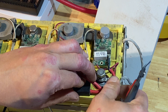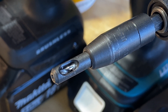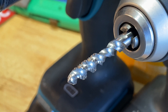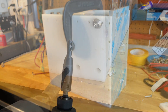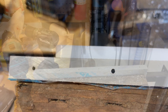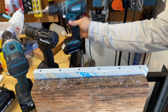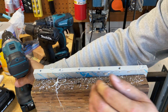The white wire connecting to each BMS board is the healthy signal. This is a pilot-guided drill bit used for drilling centered holes, followed by a standard drill bit, then an upcut tap which sends all the chip loads up out of the hole, and finally a countersink. The drill guide has a 6 mm diameter which matches the holes machined with the CNC, so the holes come out dead center. Once all the pilot holes are drilled it's quick work to drill the right hole for the tap, then run the tap — this spiral cut tap does a good job of evacuating chips from the hole.